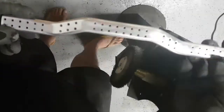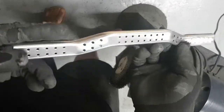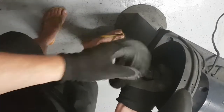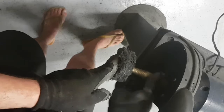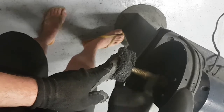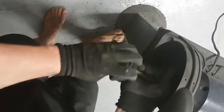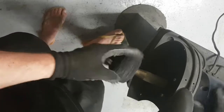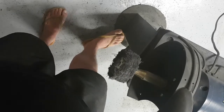That's all finished up with the brown and you can see it's really starting to come to a nice shine. I'm going to switch wheels and go over to the white wheel — I'll probably need a new one next time I'm at the hardware store. Screw that on counterclockwise so it doesn't unwind when you're polishing. It's a good polishing wheel — I've had this for a few years and done tons of jobs with it. Let's give it a crack with the white one.